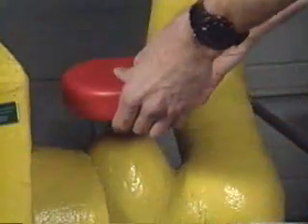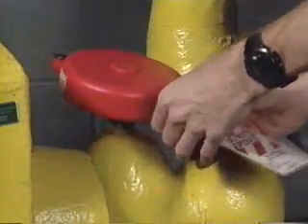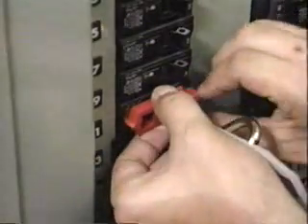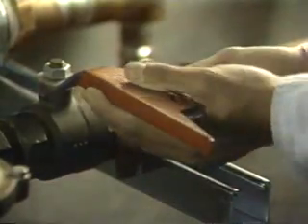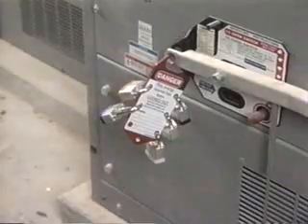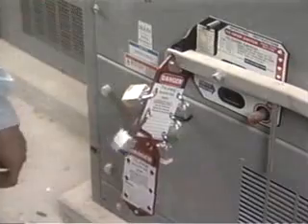For example, these allow you to lock turn valves on water and chemical pipes, and they're available in a variety of sizes. To lock a circuit breaker without built-in locking capabilities, use one or more of these devices. This can fit securely on handle valves for gas lines and they're all made in a variety of sizes. This one will accept multiple locks. You can add more locks by daisy-chaining them together.